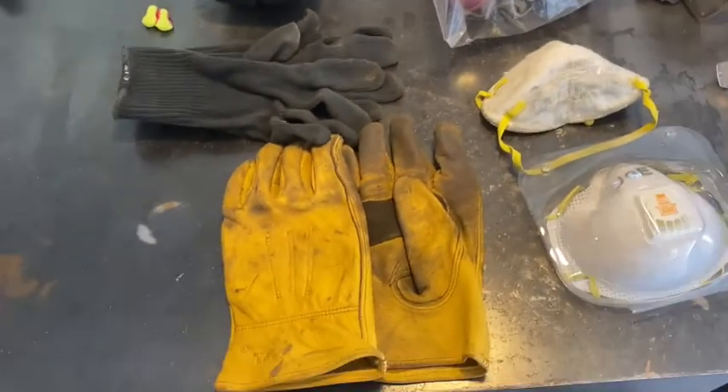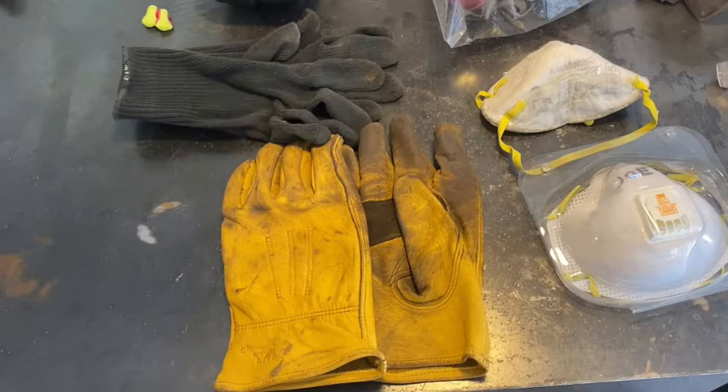We have some gloves. The one thing about gloves is they can be kind of tricky. They're good for sparks, heat, and sharp edges, but you want to keep them away from things with pinch points, like a bench grinder or a belt sander, where they can get caught and pull your hand in. Make sure they fit you well — if they're loose and floppy, they're more likely to get caught in things. Also remember, they are not indestructible. A blade will go through them, a grinding wheel will go through them, so don't treat them like they make your hands indestructible.